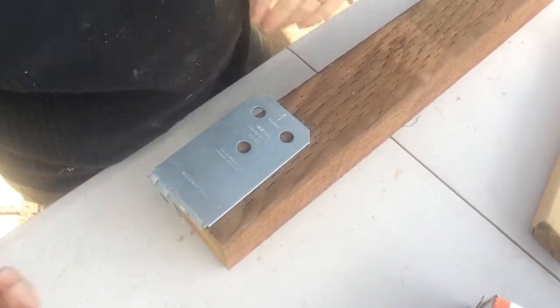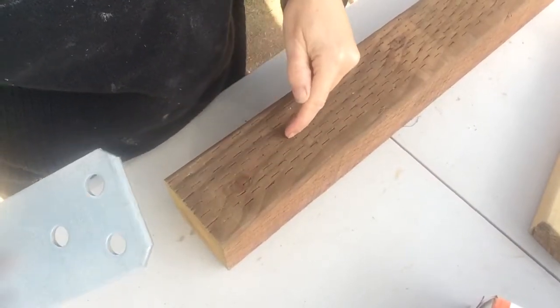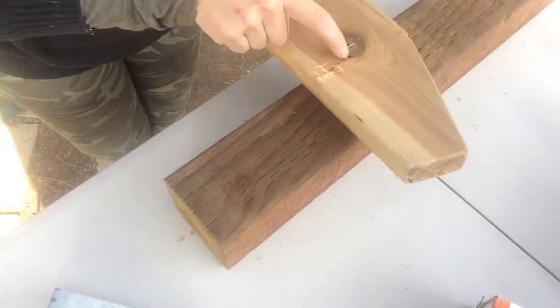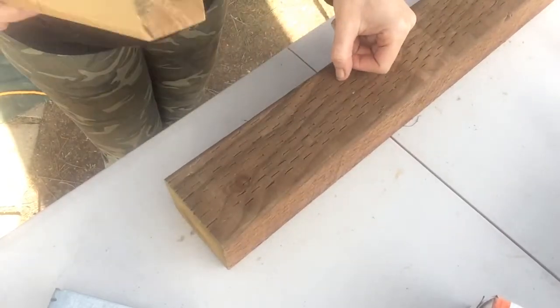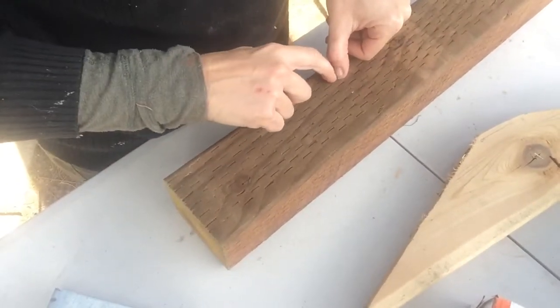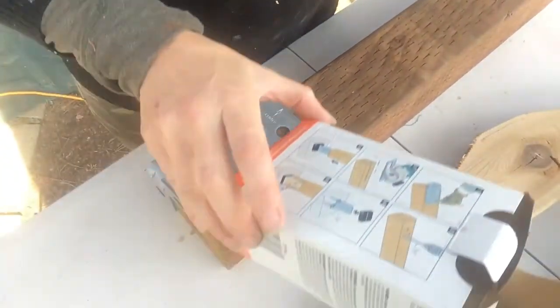Here I'm trying to define the size of the structure I'm going to build. I know I have to make the cut in the middle of my piece of wood — this is the end of the blade, so this line will go there. I need the structure to go over here because of the frame of the saw, and then I'll need some space to put a blocker. So my structure will be roughly this size.